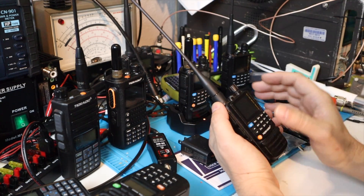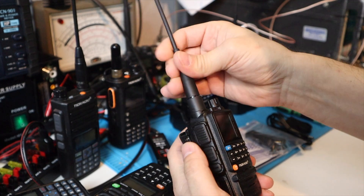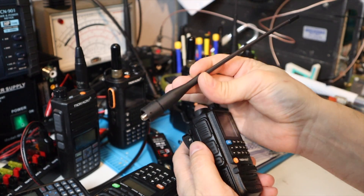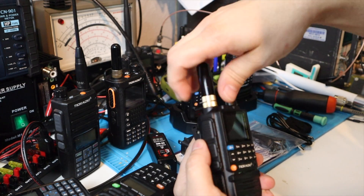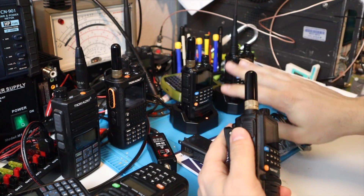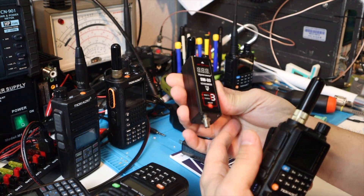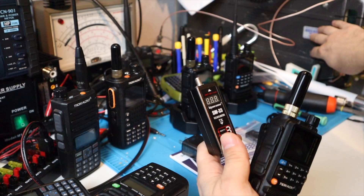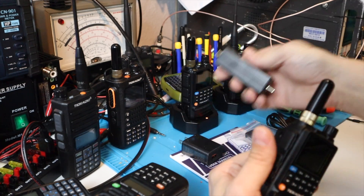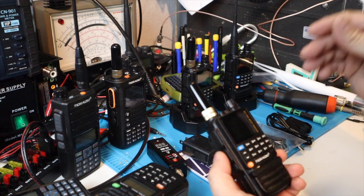There are going to be some jump cuts to save you time. If you're looking for a GMRS radio, you've found it — follow along to see why. These come with a stock antenna that's set up for ham use, with UHF and VHF calling frequencies dialed in — I confirmed that on NanoVNA. I've also checked transmission with test equipment here and I'm getting a little above 5 watts across most of the bands, specifically GMRS.